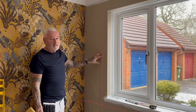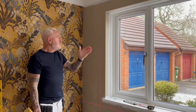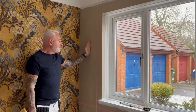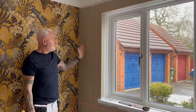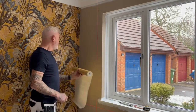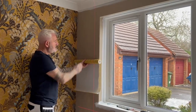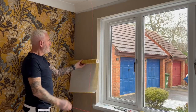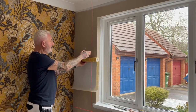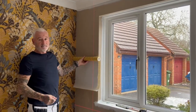You must keep your levels perfect all the time. With a hallway, you put your longest drop on first — a big nice vertical line — and work away from that. In this case, as I said, my corner's level so I'm quite happy to start in this corner, come around the wall, and it'll just wrap into the reveal and our pattern will be straight. With my laser I can make sure this pattern is always level.